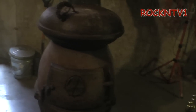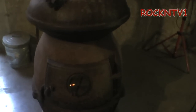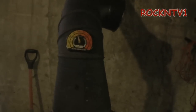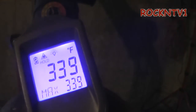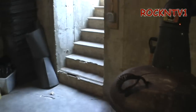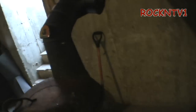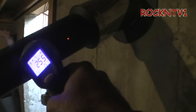That is my U.S. Army cannon heater, Number 20. She's been lit now for about all week since I put that pipe up. My insurance adjuster just left the place and he loves it — he says he's never seen such a clean install on this kind of pipe. I've got 317 to 320 degrees at the stove here, and with my damper flat closed, I've got 261 degrees in my pipe on a 45-degree day. It was in the low 20s last night.